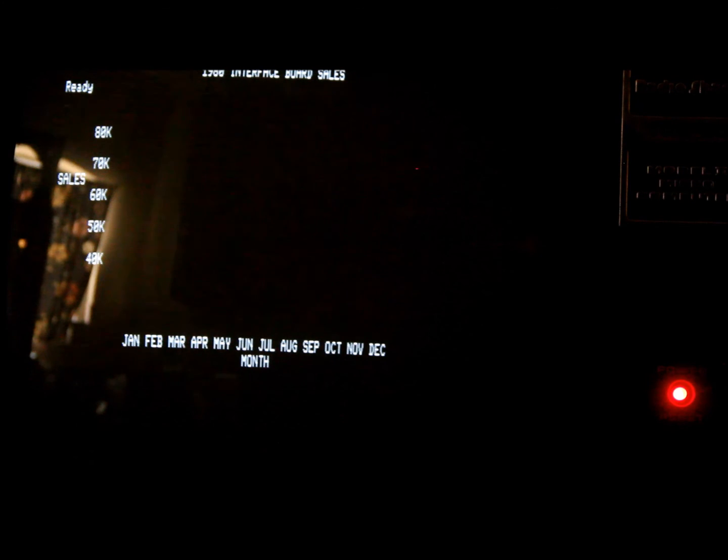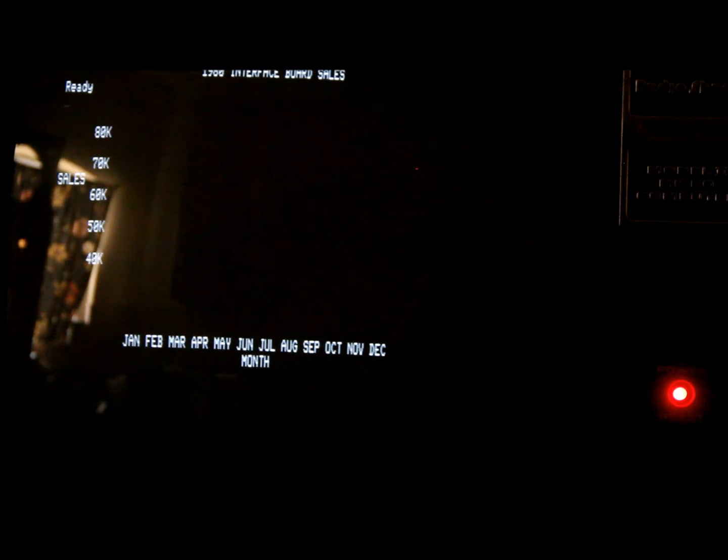I'll show that it does actually have some games. One of the discs I've provided is TRS-DOS games. This disc has to boot on its own and won't access the hard drives with TRS-DOS. Hitting reset, it's going to load up TRS-DOS. I think it's an auto-booting disc that brings up a menu with Star Trek and a few other games. If you go look for the Tandy 2 archive, it actually has quite a few disc images you can download and make your own floppies from.